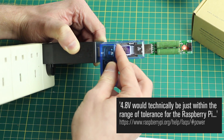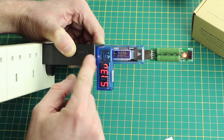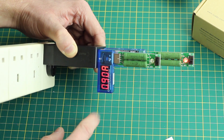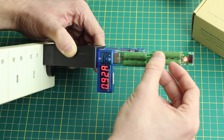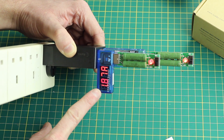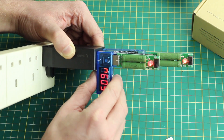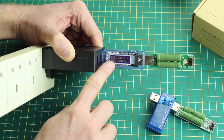Let's plug the second one in. We're reading 5.15 on the output here, so actually we have different outputs — it's not drawing from the same bus essentially. And then we have another one here we could plug in, so this is 1 amp. It says we're drawing 0.92 at 5.09 volts. If I switch it to 2 amps, we're drawing 1.86 and it's giving me 5.07, so basically 5 volts. There's a little bit of difference there. Let's unplug this one — these are going to get hot. We'll turn that off for now and you'll see we've recovered to 5 volts.